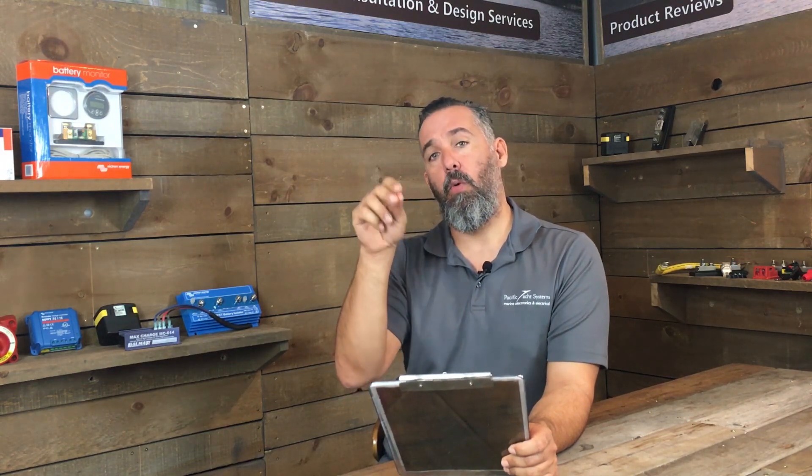The trick when you're replacing these incandescent or halogen bulbs is that in most cases, we don't have to replace the fixture and certainly not the wiring. We just end up replacing the LED bulb itself. We'll take what's called a G4 halogen bulb — it's got two little prongs — remove it, and replace it with a G4 LED version. So the replacement can be pretty straightforward. The key is to do your research, find a light that you like, and then pull the trigger and replace them all.